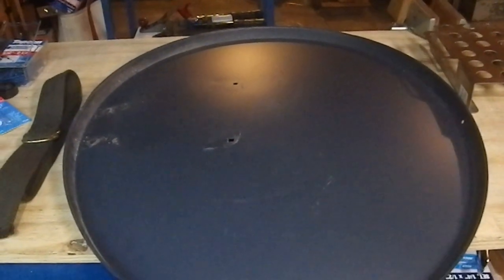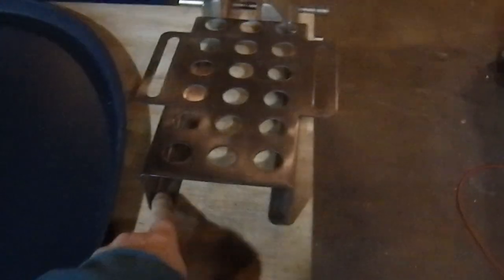So yeah, let's do some layout. I'm going to need to figure out where I want to strap this, which is going to end up here probably, and figure out if I can reuse those. Cool. If I can't, I'll have to come up and move them in and make my own holes, because I think I need 1/4 inch holes. And if I can reuse this, I already have the fasteners that were already in this from this device, and I can just reuse those, because these have square holes and those are carriage bolts, which is nice because that way they don't turn or anything. Makes assembly very simple.